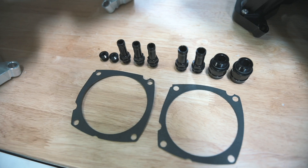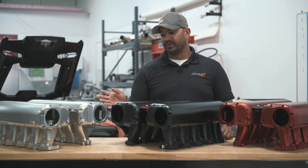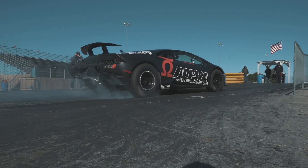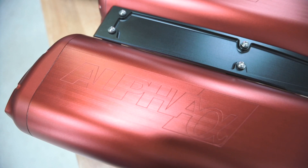In manufacturing and assembly, we put these together for you. They have a really nice aluminum core rubber-coated gasket. We pressure test them to about 50 pounds — we haven't had a chance to run them higher than that yet, but I'm sure many of you will.